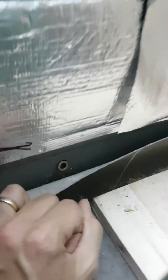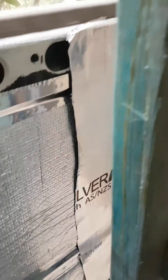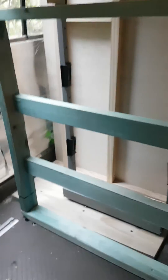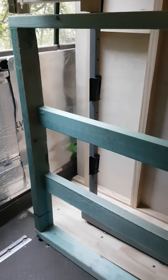We'll put those in there. I've got my rust guard, so I'm going to paint the rust guard on there, and then put the nutserts in, and then fix the frame to the floor obviously, and then to there, and then we'll get some braces in there — make sure that's all fixed in nice and strong. That will then give us a nice firm housing for the box.